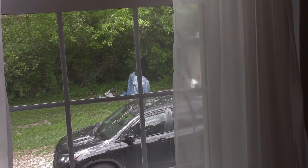So at least, hey, we know how to do it. Just definitely have your replacement window on hand, because more than likely you're going to break the old one. And a heat gun. The heat gun did help. And those scraper tools, those plastic tools I was using, are for car trims and stuff like that. You can get a set of those on Amazon. I don't remember how much they are. I've had them things for forever. But I will wrap this one up. Thanks for hanging out with me, figuring out how the hell to do this.